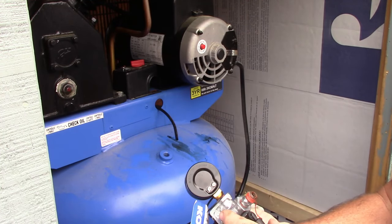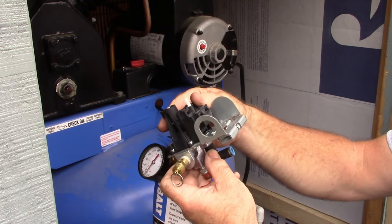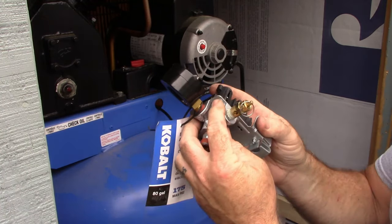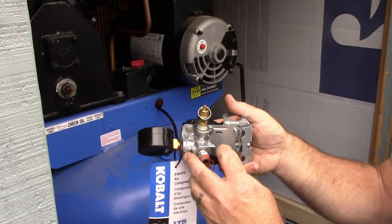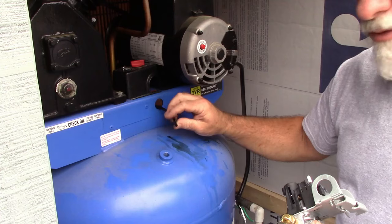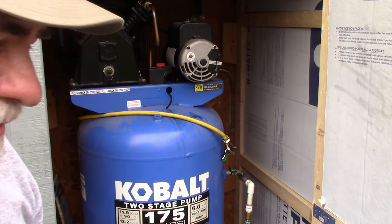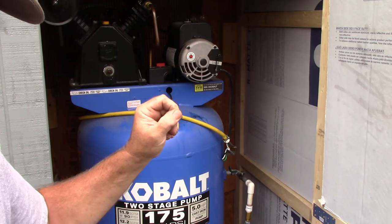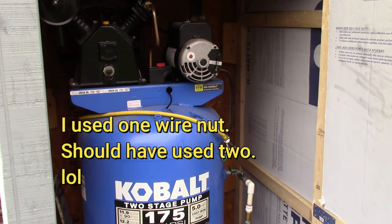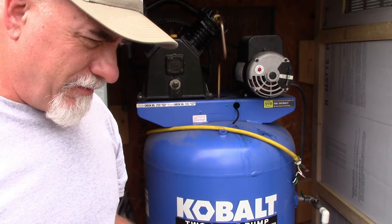I took it inside but this is all riveted together, so it's probably a dead end for inspection. My bigger concern is how I'm going to connect this piece of Teflon to another switch if I go with a different brand. I'm not recommending you do this — be warned — I've done a direct wiring to the motor and I'm going to flip the breaker just to make sure the motor is working. That verifies it — the motor is good.